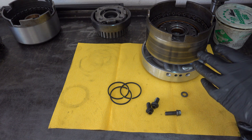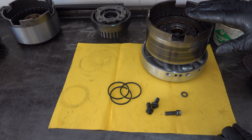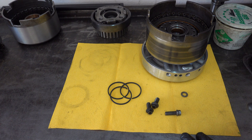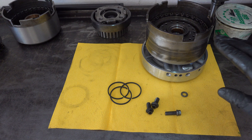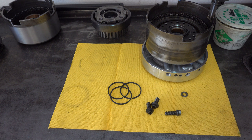I'm not aware of any sleeve that you can install where you'd bore it out oversize and install some sort of sleeve to rehabilitate the bore. If there is one, please let me know — I'd be very grateful because I have a whole bunch of these drums I'd love to rehabilitate and use again, but I can't, primarily due to the bore. The lug wear on some is acceptable, but the sealing ring grooves are cut fairly deep. It's kind of the nature of the beast.